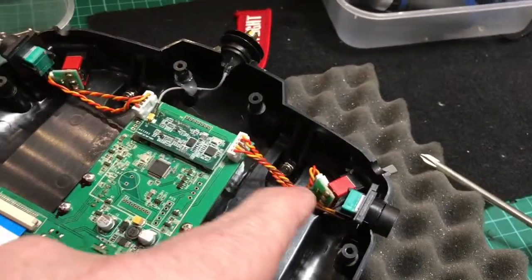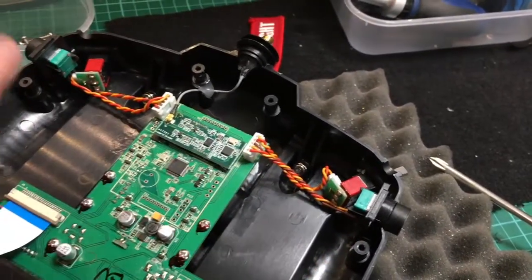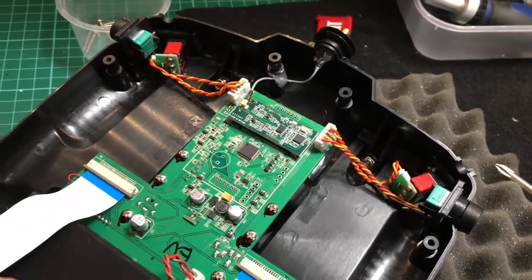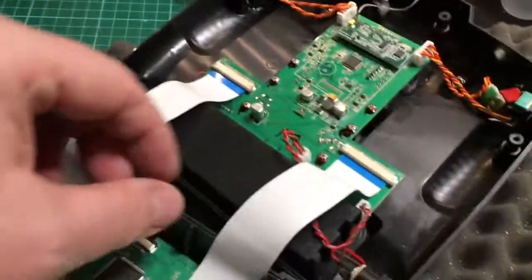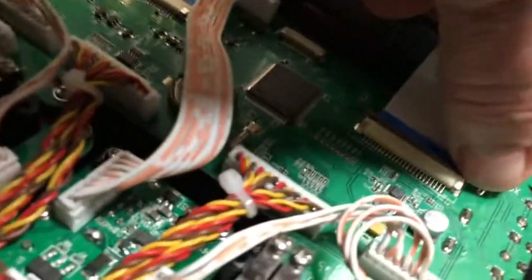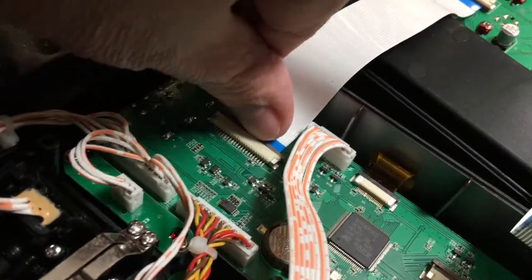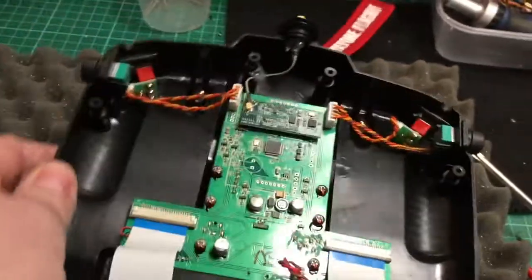What I'm going to do is take the switches out, but I'm going to mark all the top edges of the switches and put them into the box and unplug them from the boards, so that the switches are in the right orientation. I'll do them a bit at a time and it should be quite straightforward. To release these leads, there are retainers — once you pull these little brown tabs out, the ribbon comes out quite easily. So there's no yanking or pulling. It's not difficult. And that separates the two halves, so I can now do a half at a time.